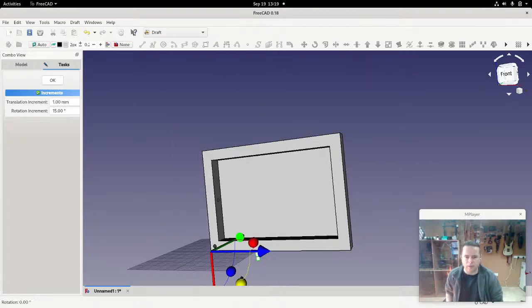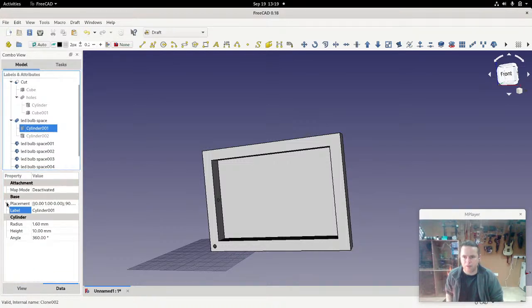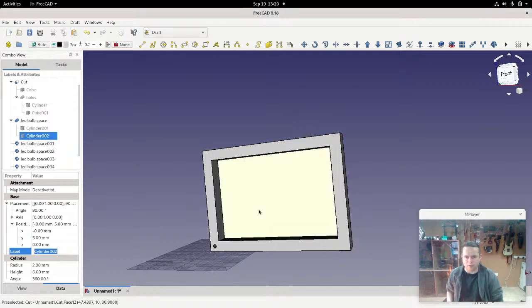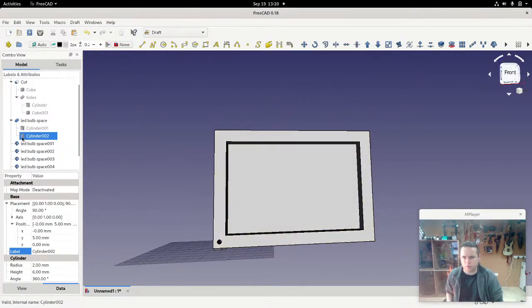So to solve that, what we can do is take the original and move it down. So we'll take this position here and move it back down. Where it says Z49, we'll just change that to Z0. And the same with the other Z, 0. We can forget about the y. The y is absolutely fine. But that's after moving all the clones now.